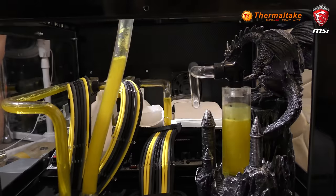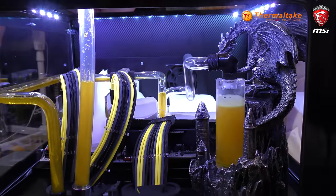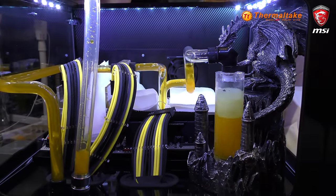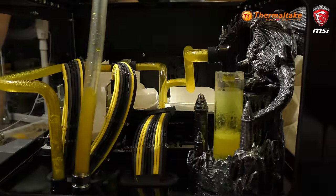We've just got the fourth and the seventh cable bridged between the 24-pin just to run everything without running the motherboard — that's the dark green and the black wire for anyone who doesn't have their cable sleeved.